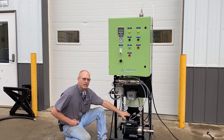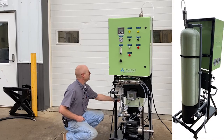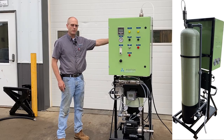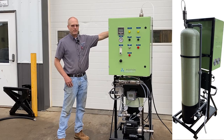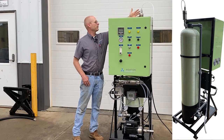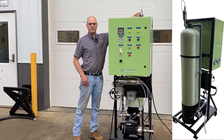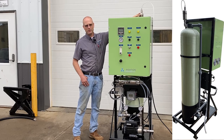Once the oxygen and ozone are introduced into the water, it continues through this pipe behind the cabinet. You can see on the bottom there's a tank — that's the off-gas tank — where the remaining oxygen and ozone get dissolved into the water. Any leftover ozone and oxygen are vented off through the top. If we didn't have this off-gas vent, eventually the tank would build up with gas and stop working. The off-gas vent allows the gases to escape but keeps the water in — a very important part of the equipment.